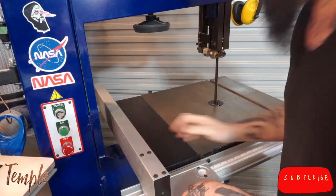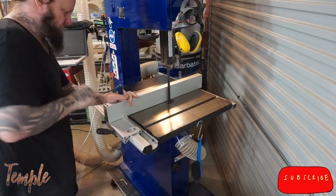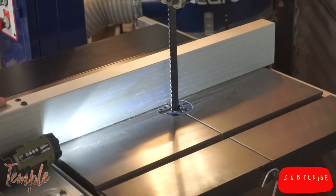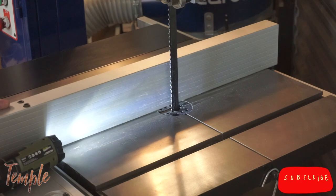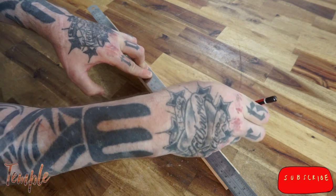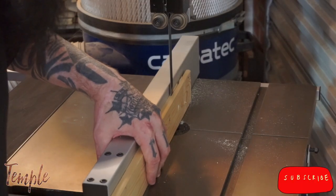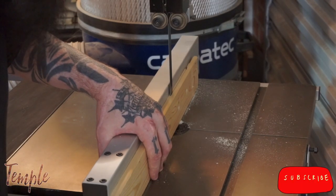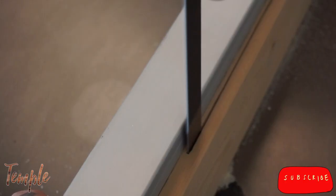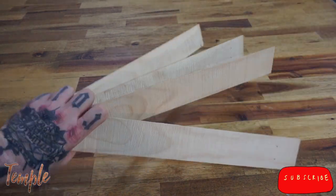Attach your fence to the machine. Loosen the adjustment bolts and position the fence so it conforms to your pencil line. Then re-tighten your bolts. Draw another line on a new workpiece, line it up with the fence, and cut. If your cut isn't perfect, make a micro-adjustment and try again. Bearing in mind that you'll be cleaning up and dimensioning your workpieces after re-sawing, most people find the level of accuracy available after their first fence adjustment to be well within necessary tolerance.